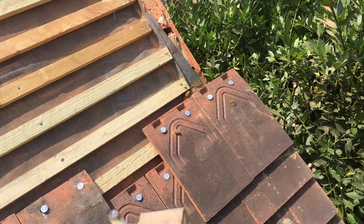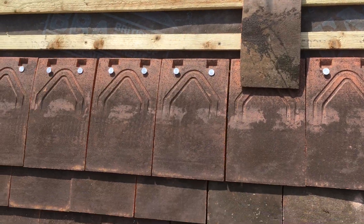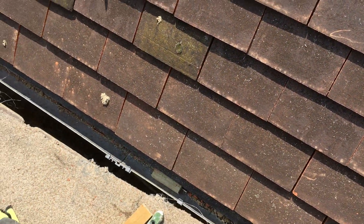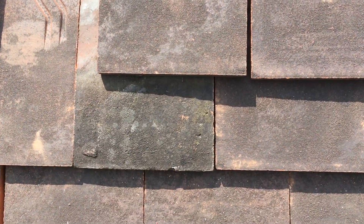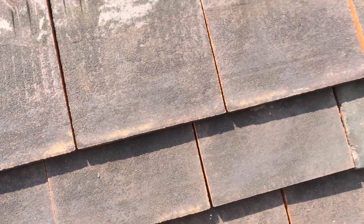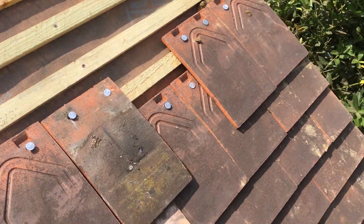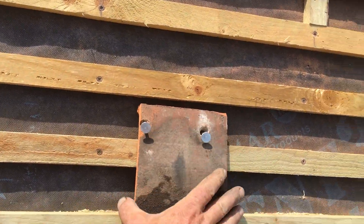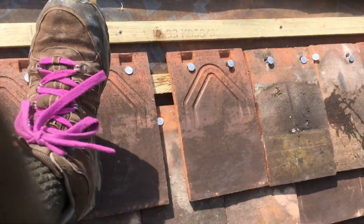I've mortared those two in and I'm working my way left to right. I got over to about here and there's one of the old tiles, and the gap — you know, it wants to be more towards the center — started creeping. So I decided I'll just cut some out of that tile that was there, stick that in there, and then I'll be able to slide that whole row over. Let's see if it works — got that one there, that's nice, a lot more towards the center now.